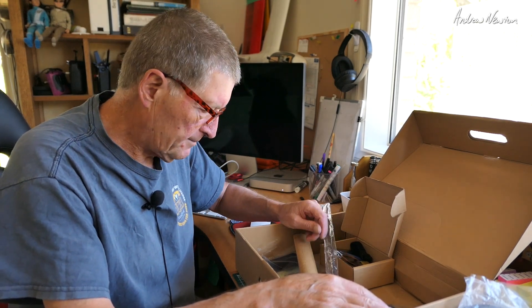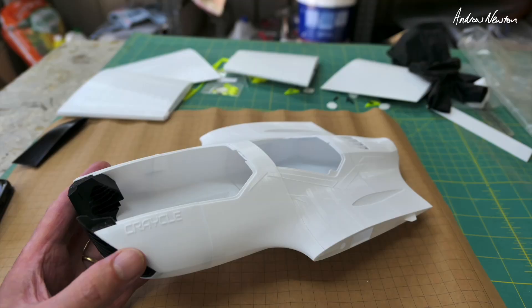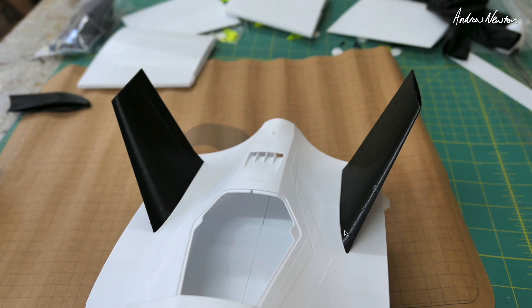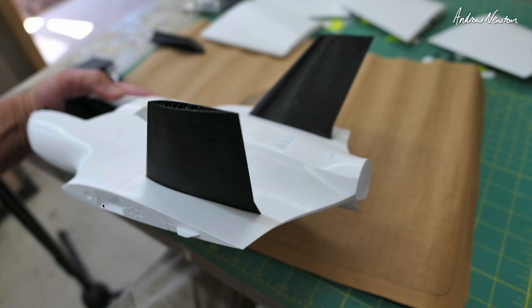I'm going to set up my build table, get out the CA glue and start assembling. There's the fuselage — it's all medium CA glue with activator sprayed on one side and CA on the other, and they just fit together nicely. There are four pieces to the fuselage plus the little nose grille. The finlets glue into their slots nicely, and in the wing root this is where the servo fits. There's a little diagram embedded in the 3D print showing which way to orient the servos, and you need to do this before continuing with the wing.